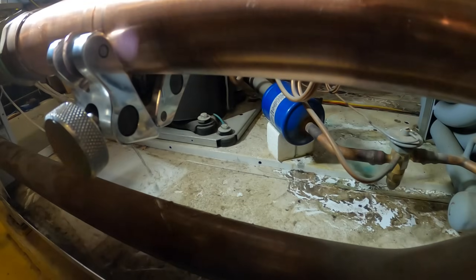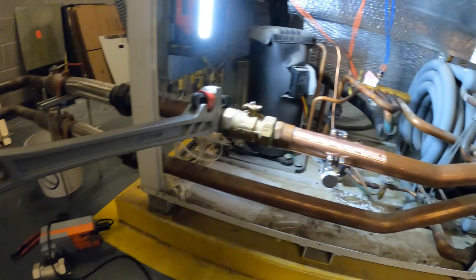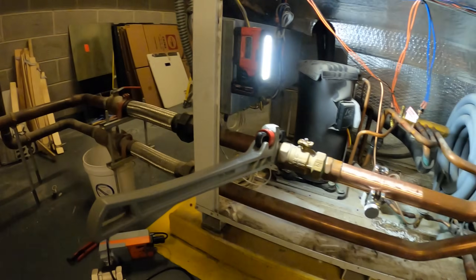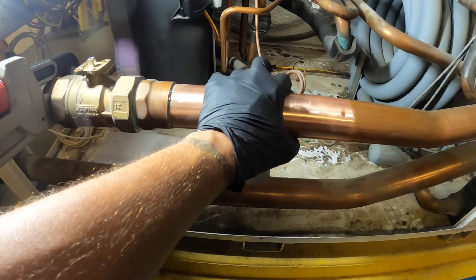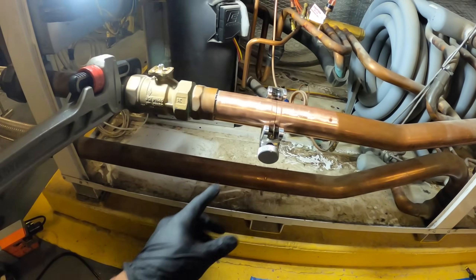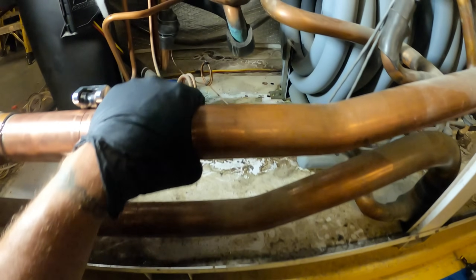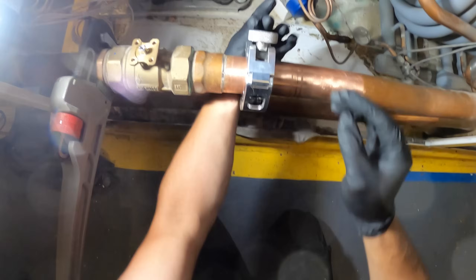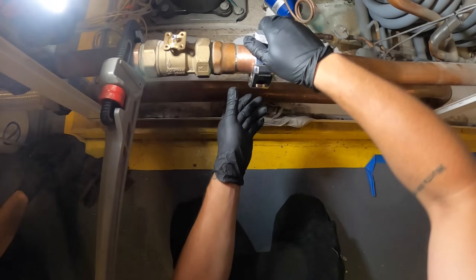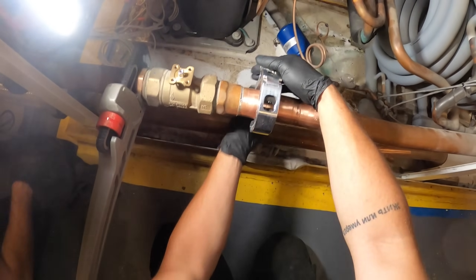All right, I got this started. We introduced air in here, so that's why it's draining. I'm going to keep that bucket there — it's all coming out through there. I might have to use the no-slip coupling because if I try to back this out, it's going to be in this pipe. So let's cut another section so we can back out this valve. What we're going to do is put in a new 2-inch male pipe adapter and a no-slip coupling.